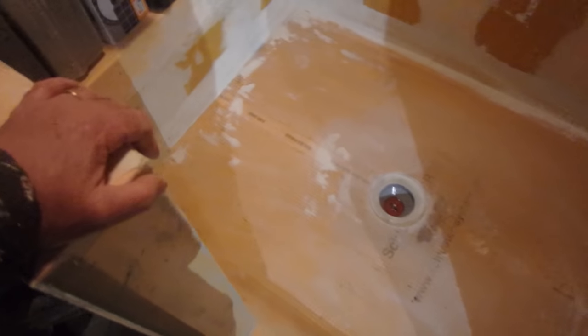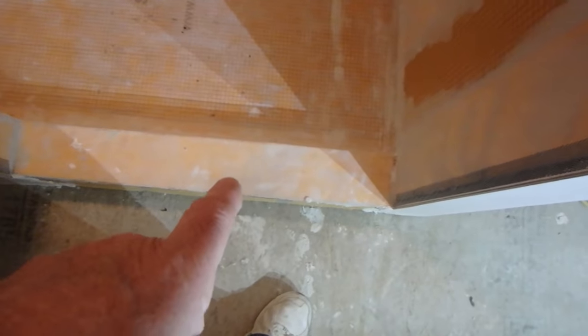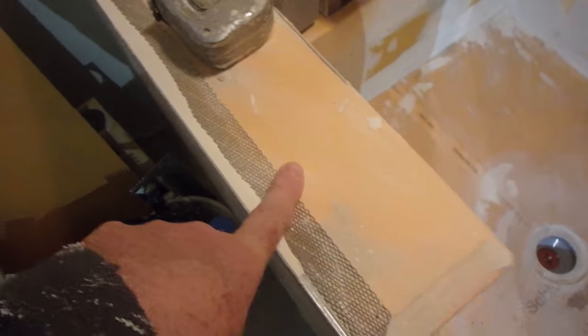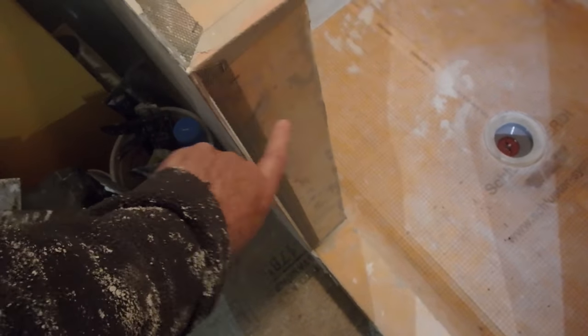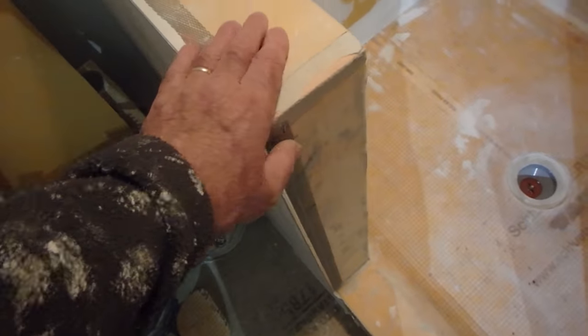So you can do it that way. Another way a lot of times people will do is they'll put the solid surface on the curb, put the solid surface on the top of the knee wall, and then just wrap the vertical part with tile. I've done that many times. In fact, that's most of the time how I do it, but sometimes it's nice to just have solid surfaces all around.